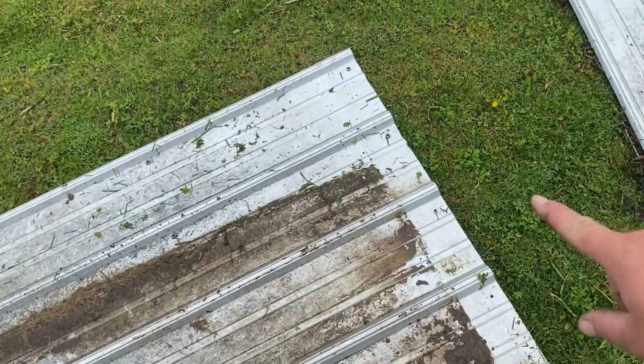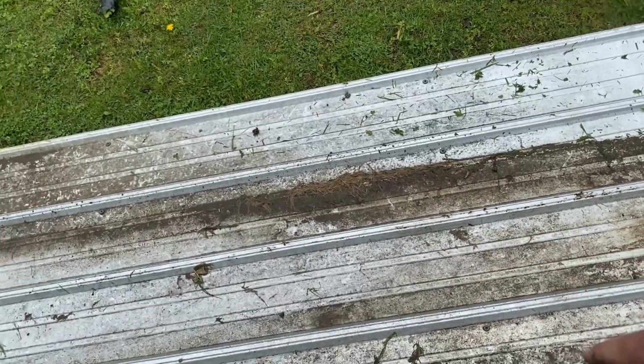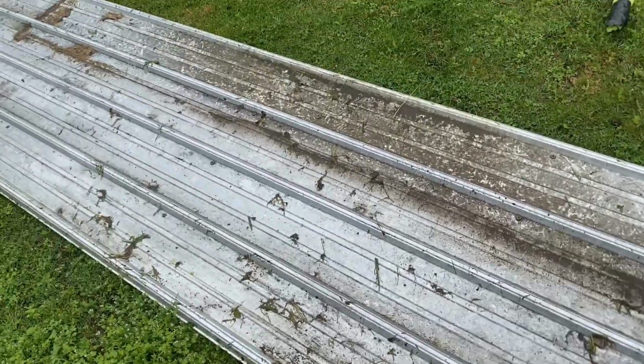Now we are ready for tin at this point, but we've also got to put those cross boards that we did, like we did on the other side. But we've got to make sure that these holes are going to be in the same spot as what the other ones were. So we're going to get this set up there before we put them boards down, and then we're going to just ease it out of the way, screw those other boards in, and then fasten that down.